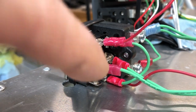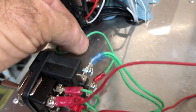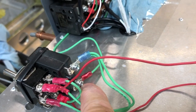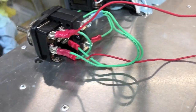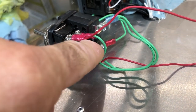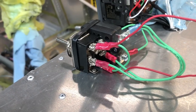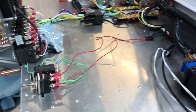The power input to the switch comes from your avionics power. The power goes first to the 5-amp breaker, and then from the output of the breaker you put two wires and power both sides of the switch. The diagram will show this — I just thought I'd physically show it in the video in case you're confused about how that works.